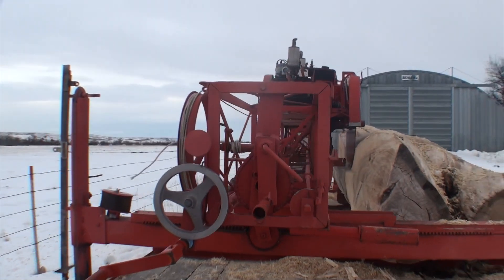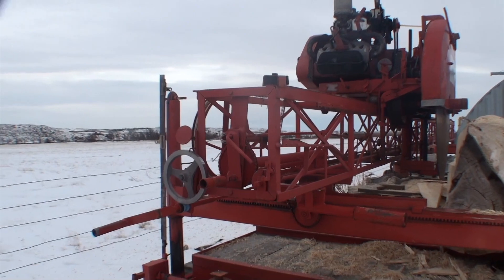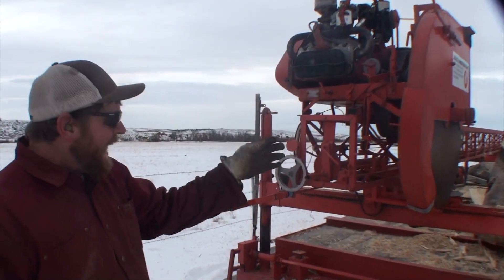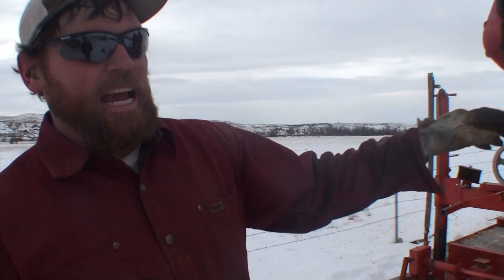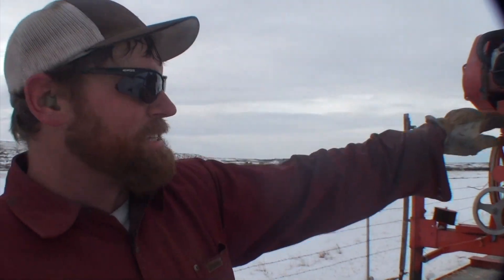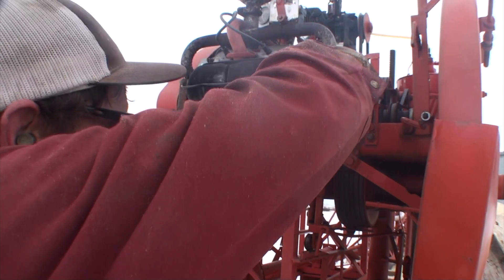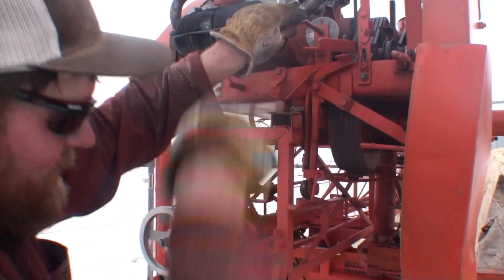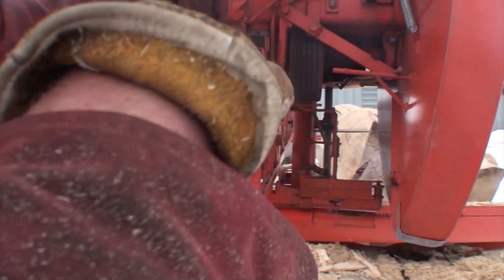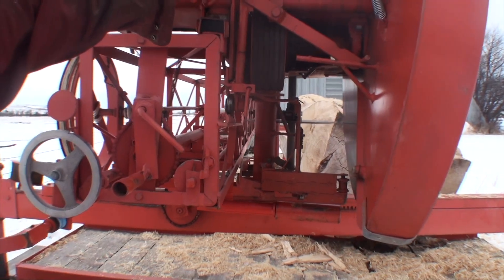I've got some older fuel in this machine and I think it's showing in the way it's running right now — it's going to sound a little healthier soon. You just continue on and adjust your top blades to produce the size of boards that you can actually get clean edges on. You just sight down the blade, and when it's flat, that's the path of travel.